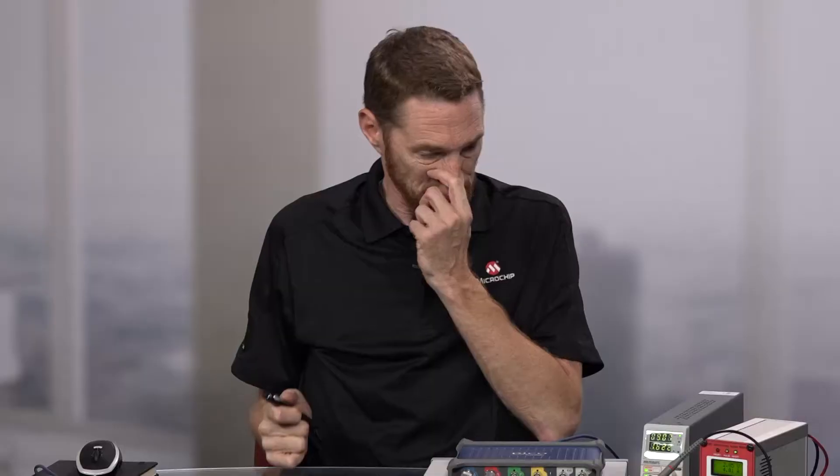An additional option to make this signal more accessible is to add an offset voltage to our feedback signal. This helps lift this fairly small AC signal out of the noise floor and also allows our controller to operate even if that signal goes negative. This offset voltage can be added by a simple resistor on the board, or you can use an internal DAC to apply a programmable offset voltage. In this example we will first install the operational amplifier, confirm DCR sensing is working, and then add a DAC to program the offset and fine-tune our feedback signal.